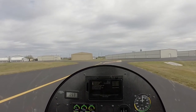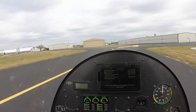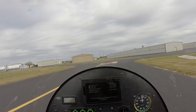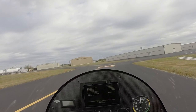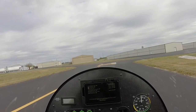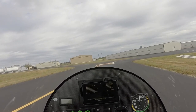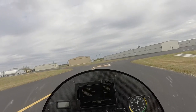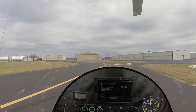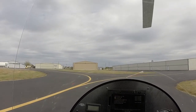Exactly. Okay, I've got the wheel brakes. Why don't you turn on the rotor brake for us? And we'll get the stick to the left into the wind as much as possible. That'll help slow it down. And it'll also take away the blade flapping. Perfect. All right, you've got the controls. We shouldn't need any extra power. It should idle just fine.